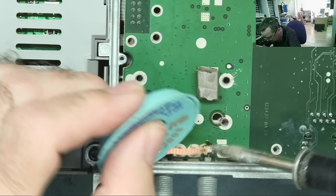What's that resistor read? This thing. Let's go to ohms range. Very low resistance, like 1 ohm or less. Okay, I'm just trying to figure out how this actually is working. It looks like maybe something coming in here. Just go back to this chip somewhere. No, it goes here. And then through a resistor to there.